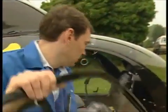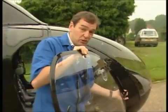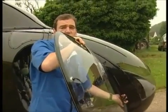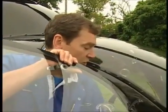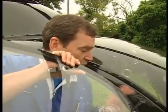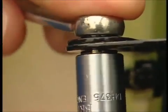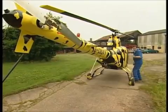The reason we've got doors on now is because I actually like flying without them - it's more exciting - but because of the test flight there's going to be lots of paperwork in the cockpit, and without the doors it will be distributed over the entire Essex countryside rather than staying available for inspection by the CAA. It slots in like that with two bolts - important not to do them too tight because the door has to be able to swing open.